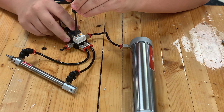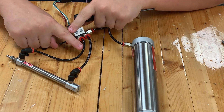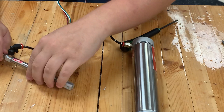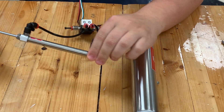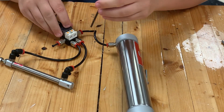When you release the button, all the air spews out. Press the other button and it retracts. What happens when you press these buttons is that little doors open and air feeds in through either input, extending or retracting the piston. With no air passing, you can freely move the piston by hand.